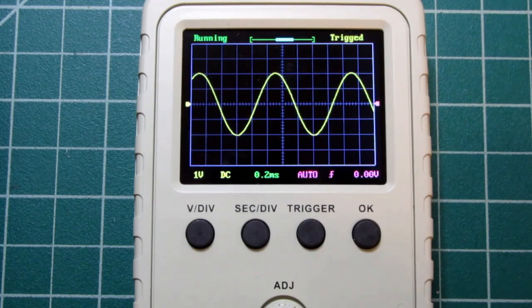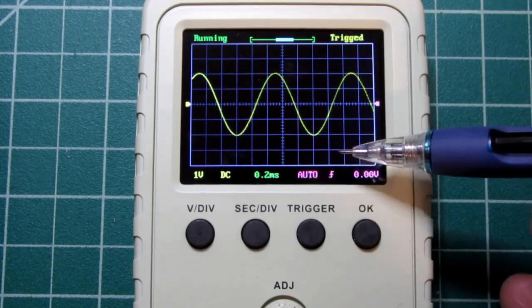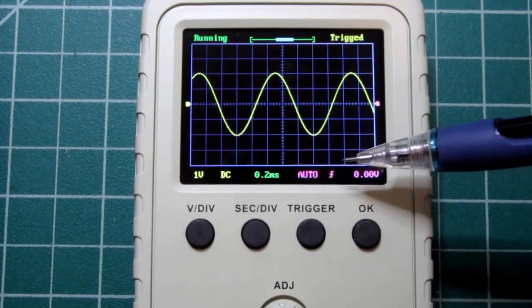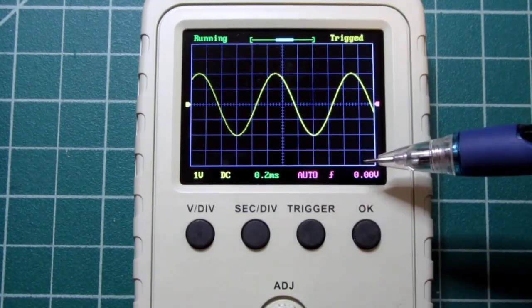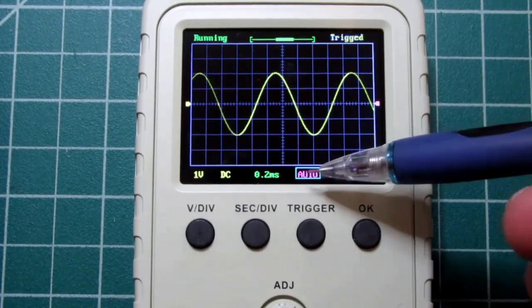Let's look at the triggering now. Just like with pretty much any oscilloscope, we have to look at the type of triggering, whether we're triggering based on an upward-going slope or a falling slope. That's not always pertinent but it's a valid adjustment for triggering found on pretty much any oscilloscope. And then we have the trigger level. Virtually any oscilloscope you could find will have these three things that need to be adjusted for triggering. I push the trigger button, and it gives me cyan highlighting showing three choices: auto, normal, and 'sing,' which is short for single.